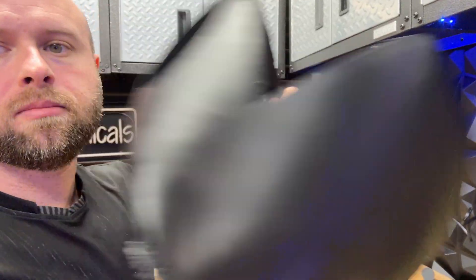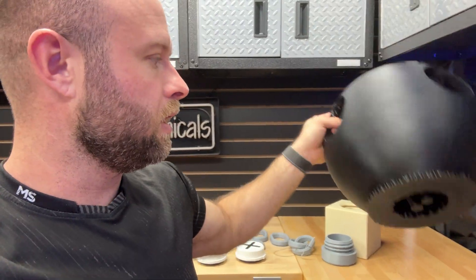I put out a video on how to solve the Cobra 2 Max layer shifting by rotating the model, but I think I'm going back on that. The Cobra 2 Max just straight-up cannot handle large models — which is kind of a ridiculous thing to say because it's marketed as a printer for really big models. You can print large models, but you have to print them really, really slow. At that point, why get a high-speed machine if you can just get a Creality S10 or S5 with a 500mm plate going at 40mm/s? I think it's the sheer weight moving back and forth on the Y-axis that the machine just can't compensate for.